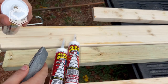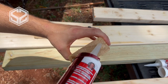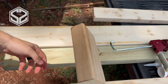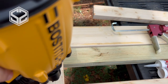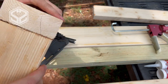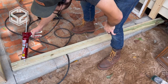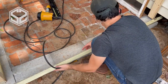Here's the Flex Glue that I'm going to be testing out today. All you're going to need is a knife and a caulking gun. The glue is really strong and sticky and it'll suction together really well once you first push the pieces together, but you're also going to need some fasteners to hold it while that glue dries. I'm not going to be adding glue to every joint on the framing, but the spots I feel like it works really well with is along the bottom board, bonding the wood with the cement.